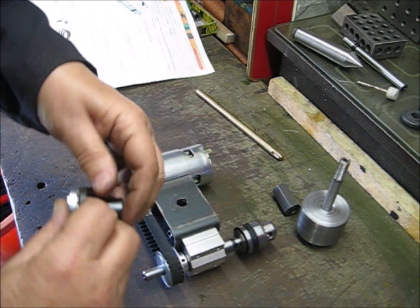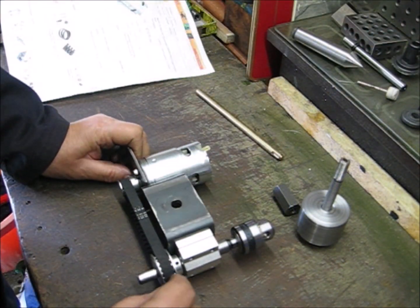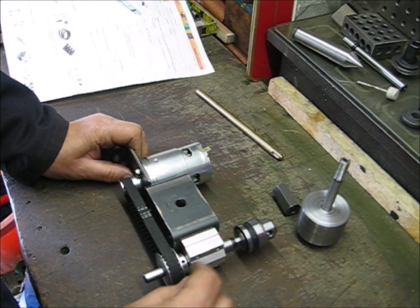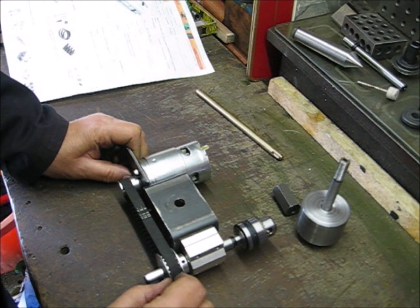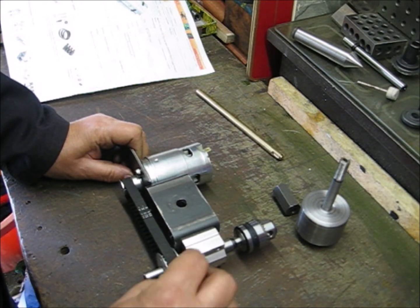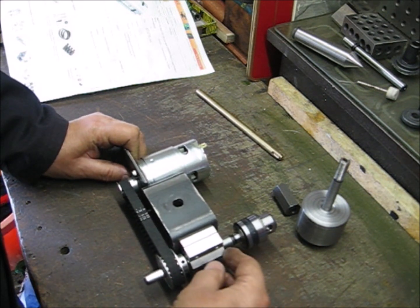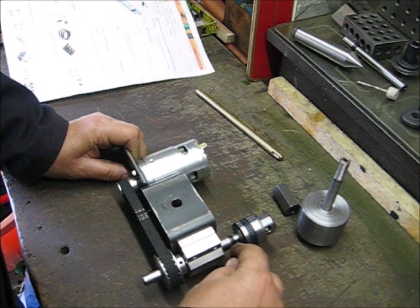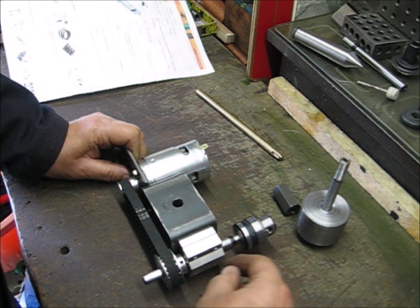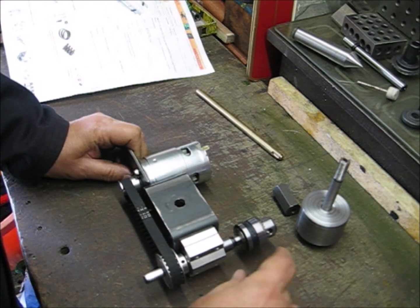There's a little spring washer in here between the pulley and the bearing housing — when I first saw it I wasn't quite sure what it was about. It's there really just to keep the thrust off and it locates in the race. Something I've added to this one: it hasn't got anything for thrust at this end, so if you've got an axial load it could push it back into the bearing. So what I've done is put a little thrust collar there that takes the thrust.